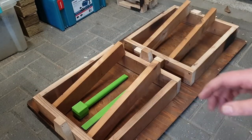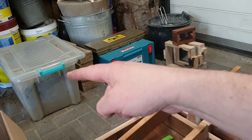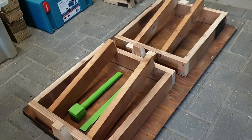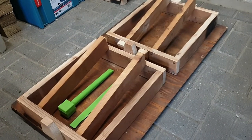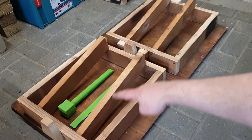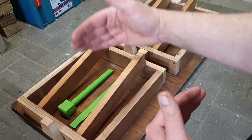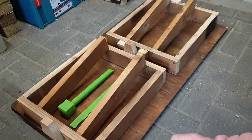The amount of green sand I have over there - the full tote - when compressed goes all in there, and it's going to be extremely heavy and annoying to lift. So I'm going to be putting these wooden beams in there and making the compartment slightly smaller so there's less sand to be rammed. I will leave enough room for sprues and feeders and whatnot. So let me go and adjust the flasks and then start with the sand ramming.